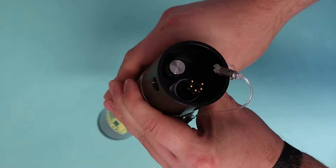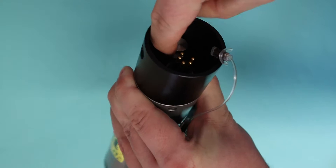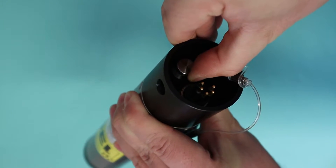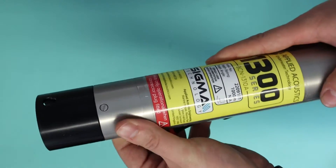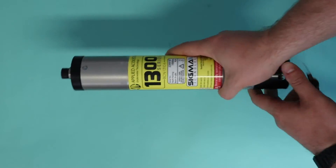Although it is difficult to see in the video, the PRV has a single o-ring that should be checked for damage, debris buildup, and that it is properly lubricated. To re-lubricate the o-ring, use a small amount of Parker O-Lube. If any damage to the PRV is noted, the beacon should be returned for repair. This is a safety feature and should be treated as such.